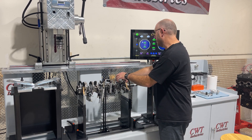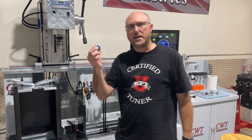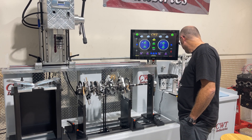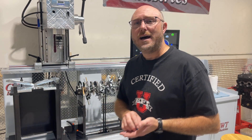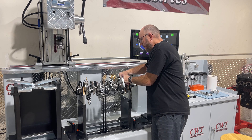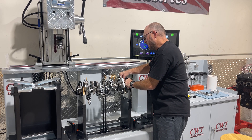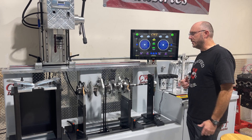So if this is at TDC, I'm heavy here and I would need to take weight away — but I don't want to go in here and just start hacking on my beautiful crankshaft. So I want to simulate a little bit of what that might look like. I'm going to turn the crank over to 180 degrees and grab this tiny little bit of clay — just this amount. Now this is a little more than my 6.675 grams; this is actually about 8.6 grams, but it's tiny. I'm using a little bit more simply because I'm spreading the clay out a little bit as I'm putting it on, so I'm just going to put that on here, do another run, and see what happens.